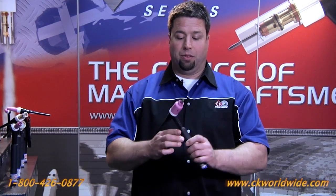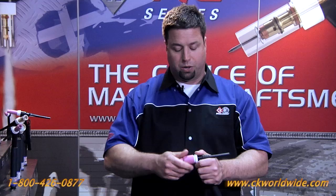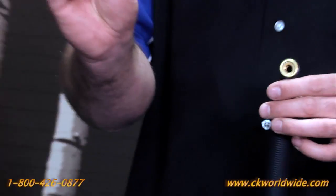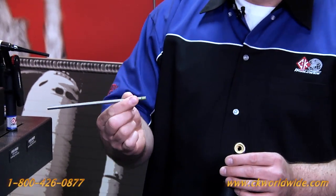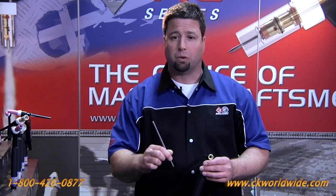The way we accomplish that is we have two sets of threads actually in the torch head of the CK510, and I thought I'd disassemble that just to show you. That's a quarter inch electrode by the way, and I can't say I've ever held onto a 500 amp TIG torch using a quarter inch electrode myself, but there might be an application maybe in a tube mill or some sort of heavy duty overlay application where a quarter inch tungsten or a 3/16 tungsten is required.